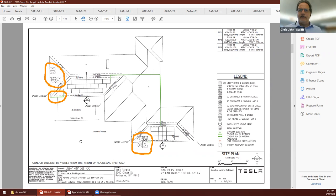A lot of these we see conduit making longer runs going through the attic, not across the top of the roof. Did you look at the feasibility of putting some of this conduit under the roof in the attic space? Honestly, I'm the permit and inspections coordinator, so I approached my design team with your requirements. This is what they designed. If you'd prefer more of this conduit inside the house, we could potentially do that — we'd need to do another evaluation.